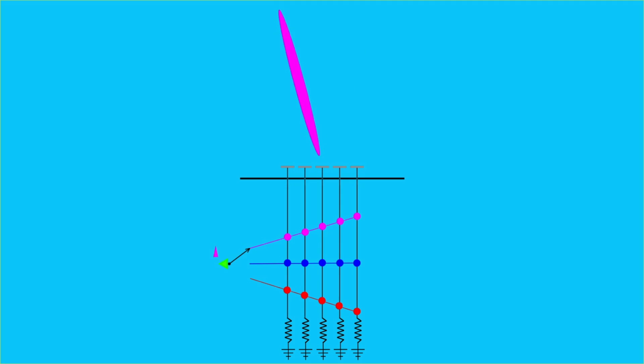This isn't the only way to scan a beam across the sky. There are schemes that can sweep a beam across the sky by slightly changing the transmit or receive frequency. Another method uses devices called ferrite rings. The current passes through and around the rings, and this slightly changes the current's phase. Adding currents together with slightly changed phases for each has the effect of steering the beam.